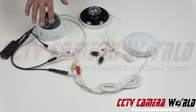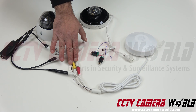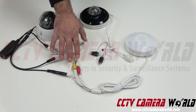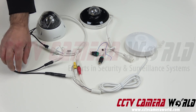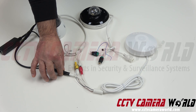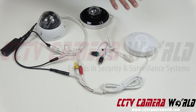So to recap: on an audio input on a PoE camera that already has RCA terminations, you can have a clean connection. The only things you need are a PoE power splitter, a DC power splitter, a DC coupler, and your two-way audio box — four things in addition to the camera and its PoE power source.